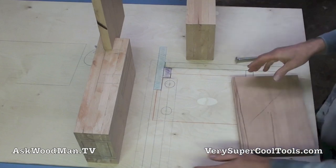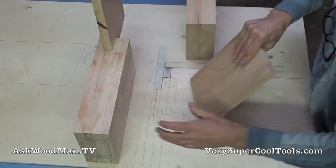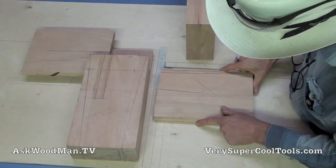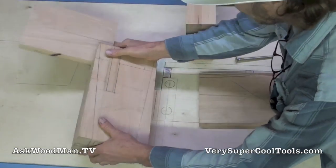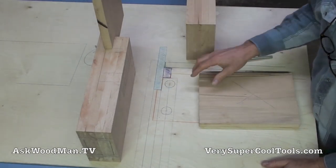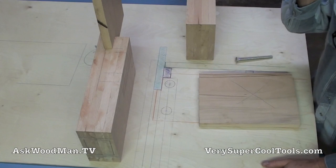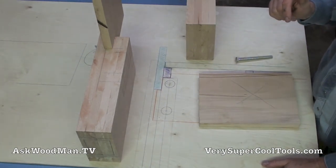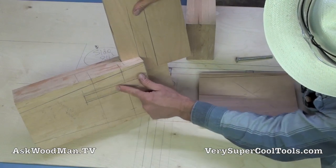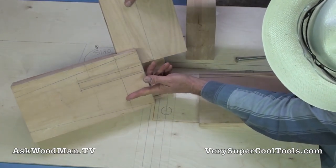It had been a long time since I'd done one of these. This piece of wood here represents the connector, and this connector is going to get routed down into here and back into the leg to the orange line. What I was doing first was trying to get my drill position, and I realized this is incorrect up here because I'm going to use a one and an eighth inch drill bit to countersink down to the proper level. On this side, this one and an eighth inch hole is going to come all the way through to the slot — that's where the nut is going to be.